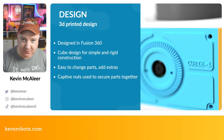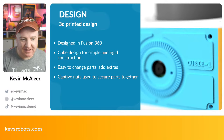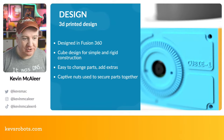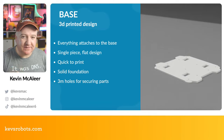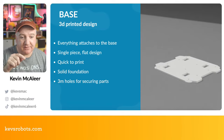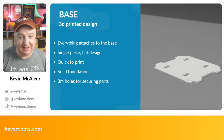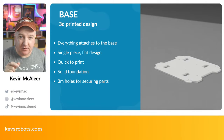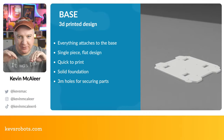If we want a different front panel, or one wasn't printed quite right, all these modules can simply be unscrewed and put back — the whole thing is put together with captive nuts. The base is the very first part of the robot — a nice flat base with indentations at the very edges where the corner pillars locate and are screwed from underneath with a single screw. It also has little tabs for the wheels so they push out enough from the side for clearance. Being a single flat piece, it's about 3mm high and prints in about three hours.